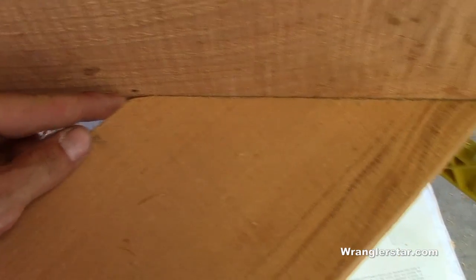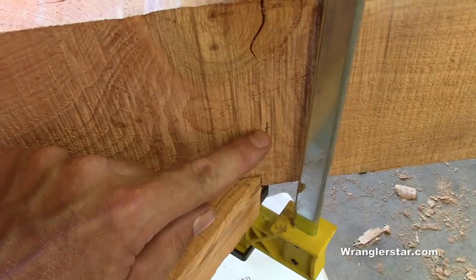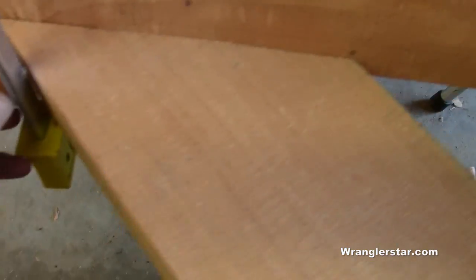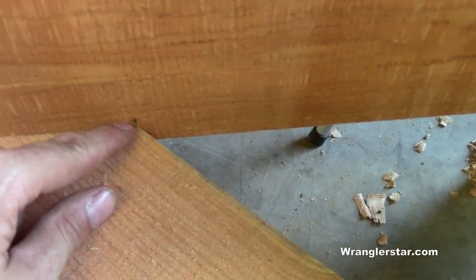We have to take these marks very carefully at the very corners where this goes in — bring them up one inch, then chisel out three inches deep, an inch-and-a-half mortise. Same on this side. I've got my marks transferred and I'll break this whole bit down.